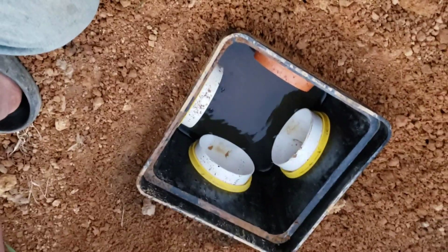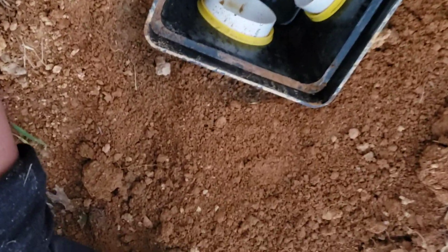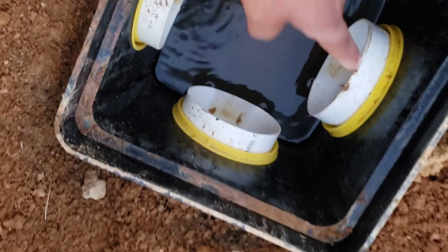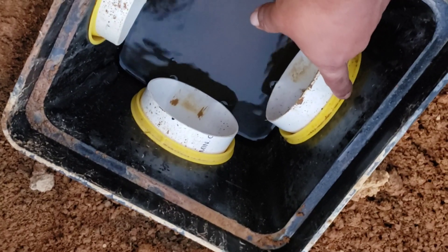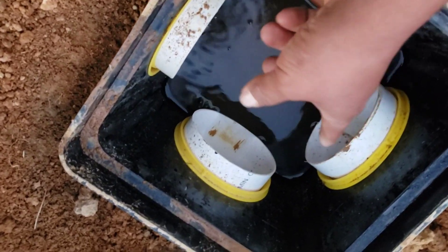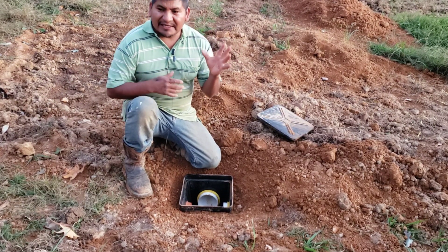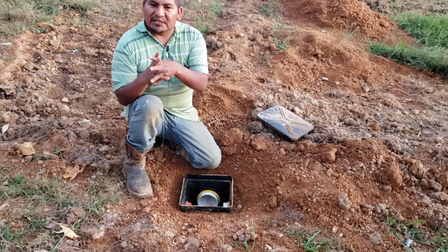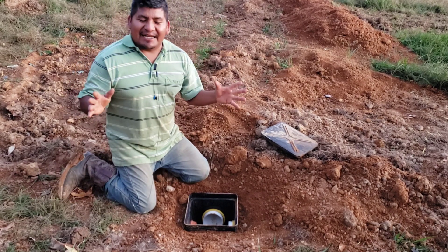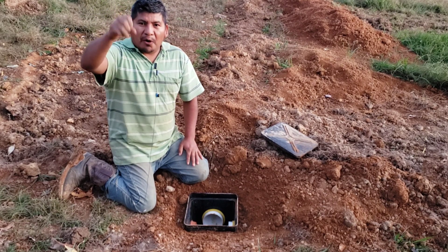A quick tip: if you guys can use this distribution box for your project, it is very tough and strong — nothing to worry about. But number one: make sure to use silicone around the grommets before you pull the pipe through, because on mine I only used the yellow O-ring grommet with no silicone, and it does not leak much. Alright guys, that's it — thank you for watching. If you like this video, don't forget to subscribe. Thank you very much for your support. Until next video, bye for now!